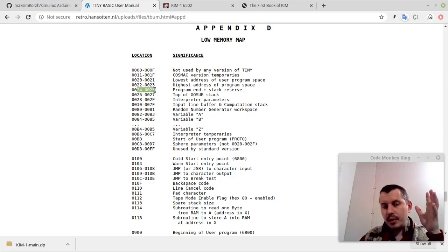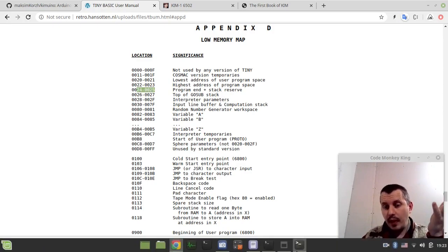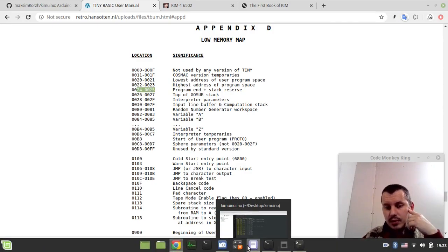What I've added to my tiny little drivers, besides initializing those addresses for the move it utility, is some code at the beginning of those two drivers that directly stores the values at 24 and 25 in zero page to 2900 and 2901 of the EEPROM, and back. And here is the code that does this.